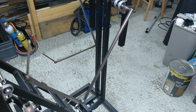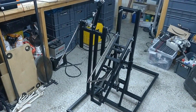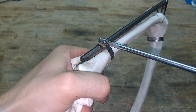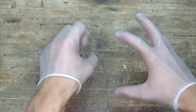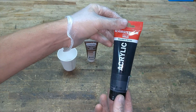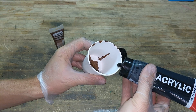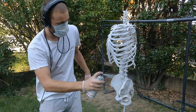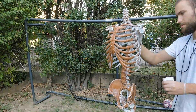The nice thing with pneumatic cylinders is that because the air inside them is compressible, they naturally offer great suspension and shock absorption. Let's get painting. This is dark brown pigment for paint, plaster and whatnot, and this is basic black acrylic. The trick is to mix these together and to dilute them in plenty of water. After spraying down the model with primer, the mix can simply be brushed on, letting the mixture drip down as this will give it a nice aging effect.